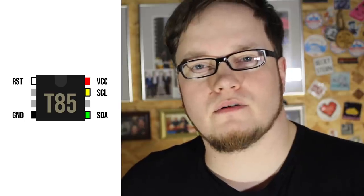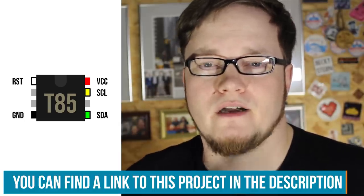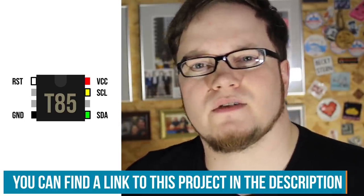While searching for ways to improve my design, I found Daniel Champagne's project. He shows games and schematics for a Tiny85 based handheld with the same I2C OLED display that I use. And it even has a buzzer. The reset pin of the Tiny here is used as an extra input. Doing this means you cannot easily program the Tiny anymore. There's a fuse you can set for the Tinys, and when you set that fuse, the reset pin isn't a reset pin anymore, and you need that in the ISP communication to program a Tiny.